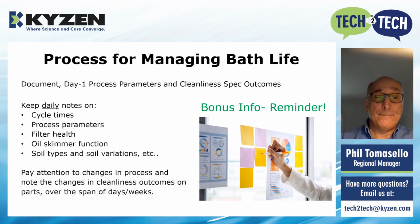Do you run it overnight? Take a look at soil types that you're running and the variations of soils that are coming into your machine. And this all will help you build a really good view from day one, let's say through day 30, as to what those parameters are and what needs to change. Because as you go through that data and that document, you're going to see, okay, at day 29 or day 25, my cleanliness outcomes started dropping off. That's a great indicator, right? And that's where you want to start paying attention to those variables. Take a look at those data points.